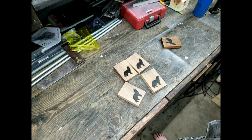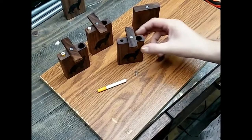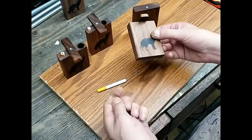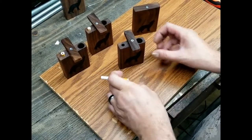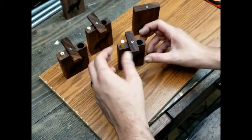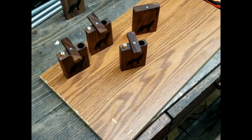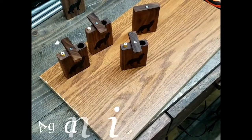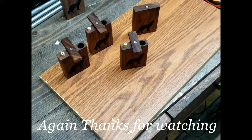Just got done sanding with 120 grit. Butcher block conditioner is put on right afterwards — it's still very wet and I haven't let it dry yet. The spring goes into the 5/8ths hole and the little hitter goes in right afterwards, close it up and you're all set. I decided not to do the routed edges because the top is actually very flimsy — I already had two of these split, but did a pretty good job gluing them back up because I can't even tell which one split. Hope you enjoyed the video, give me a like, subscribe if you want to, and I'll have another video out next week. Hope you have a great day.